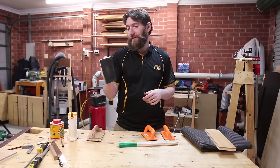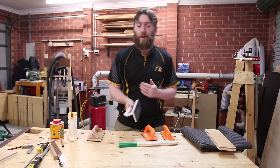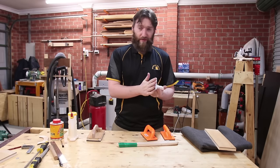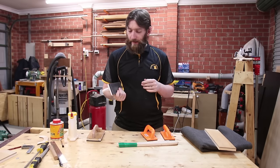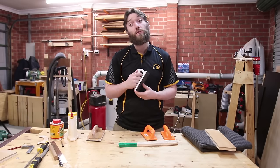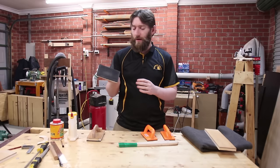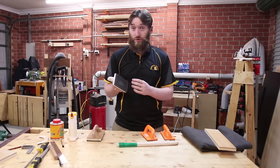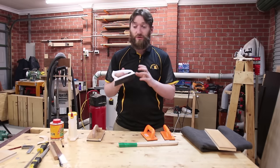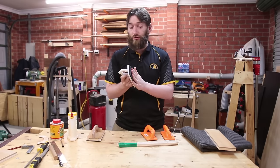This is the push block that came with my jointer, or my combo machine which you can see in the background there, and it's okay. It certainly does the pushing thing pretty well, the grip is fairly good, but it has an issue with long boards where you may not have a lot of grip, particularly if it's a rough surface — these sort of pads just don't work so great. One of the commercial alternatives around that is a gravity heel system which hooks onto the end of it so that you can actually drag it along rather than just relying on the friction of the push pad.